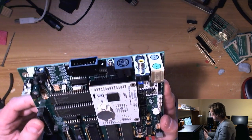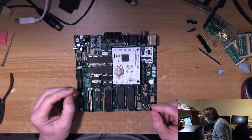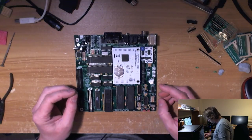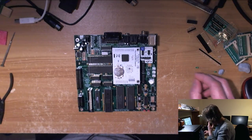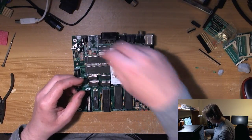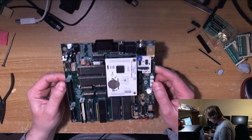I guess I should jumper that stereo jumper as well. Or is that a disabled jumper? I'm assuming it's an enable. So, oscillators jumpered, PALs jumpered. I haven't got this in, so I don't need the... It's not a jumper. Oh, it's a diode. It's an LED. Sorry, silly me. I'll stick this on CTS or something just for now so that I don't lose it. Yes, the diode mark on the silk screen would tend to give that away.